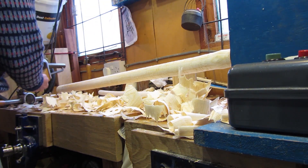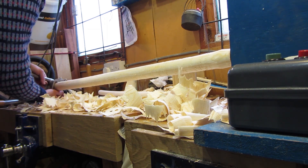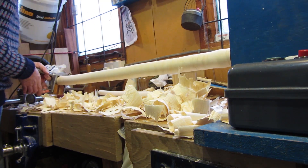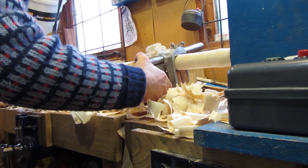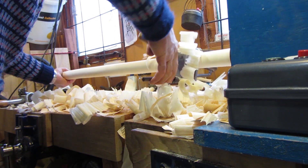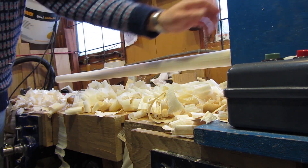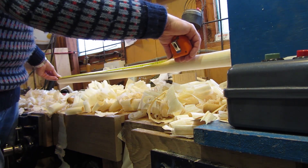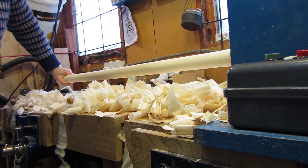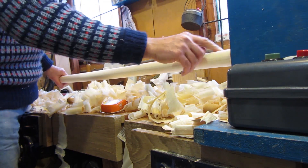The rear legs of the Sussex chair are generally a bit more chunky overall so I'm going to smooth this out further. That's roughed out — fairly smoothly — one of the rear legs. The actual rear legs themselves are 33 and a half inches, so I've got quite a little bit of margin to play around with, which I like. I've got about six inches on the end. I'll probably do a bit more tapering down this end, and it has a bit of tapering up the headstock end too, so I'll rotate this and do some tapering on each end.